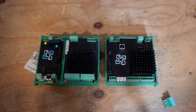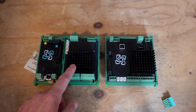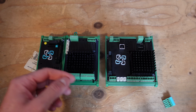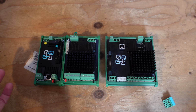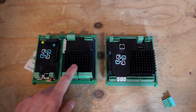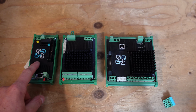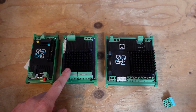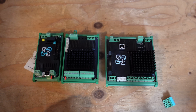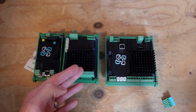The other big difference between the Watchmon 5 and the Watchmon Core, obviously this supports 16S, and in my opinion 16S should have really been done from the start. I know there were a number of issues with chipsets and things like that. So obviously the biggest difference between the Watchmon 5 and the Watchmon Core plus K9 is that they are separated. They have separated the supervisor or computer component from the actual cell monitoring and cell balancing. Additionally, they removed a lot of the computer logic that was in the MM8 from this K9, which makes the K9 for cell monitoring significantly cheaper.